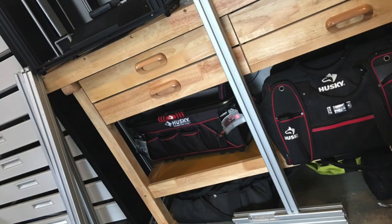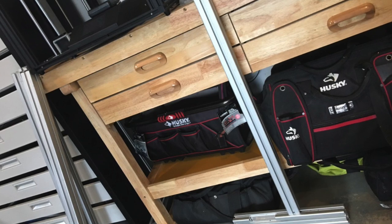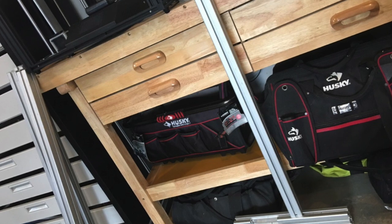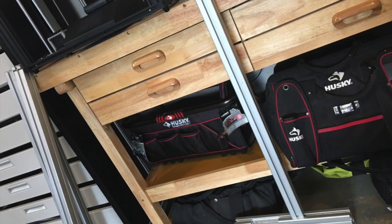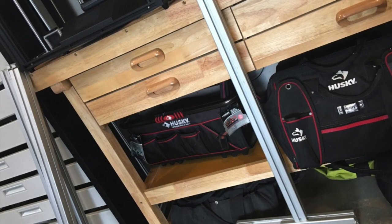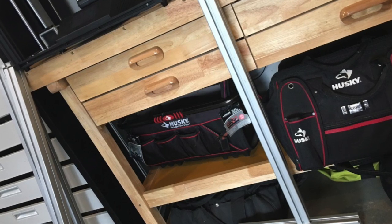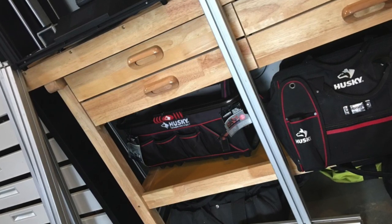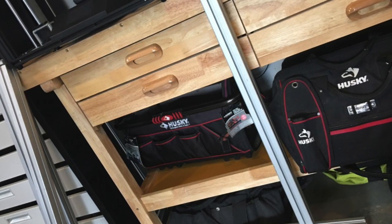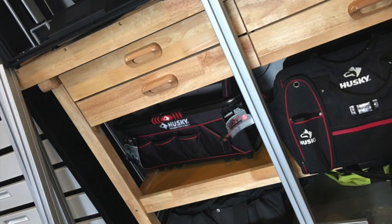I took two pieces of scrap and what is going to be the table leg, and placed it against the workbench because I really want all the tables and workbenches to be the same height around the garage. By doing this, I can get an accurate measurement, because I'm also going to be using a platform with wheels on it, with about a 1 inch gap. It was determined with these measurements that each of the pieces for the legs are going to be 29.5 inches long.